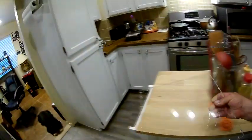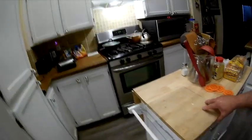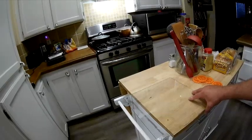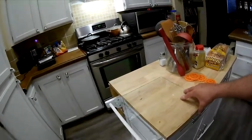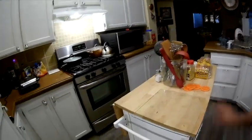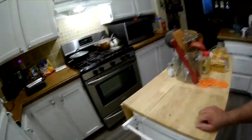I just thought I'd pass this on to everybody because it took me 3 or 4 days. I had a few difficulties with prints the day I got the printer, the next day, and the day after that — until I realized that once I let it cool all the way down, they just come right off like butter. The bottom line is: if you're fighting with your printer trying to get off your prints, there's no reason to do that. Simply let the glass cool down all the way and they come off very easy. You don't have to force it, bang on them, or scrape at them.